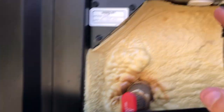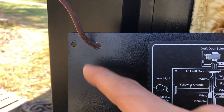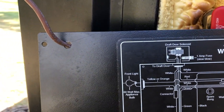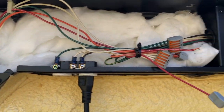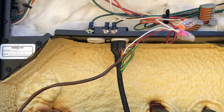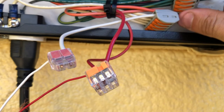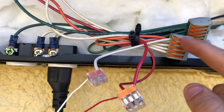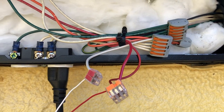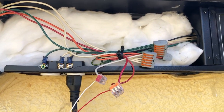So I've drilled a hole through here. I was going to go through this header plate, but this header plate is full of insulation, so I decided to come down around the side here, tuck it back in, and go through the panel. I'll put a rubber grommet on this later when I drill a bigger hole, but right now I don't have the correct size grommet so we're going to just be careful with it and put it together. Alright guys, I tapped my thermostat wire in here to the red one, made a three-connector, then tapped into the white wire with a regular piece of wire and made my own two-port Wago. So I didn't mess with the factory wiring at all — I just put a new connector here. It can always be put back to normal with the original Wago. Going to wrap this up, put the cover back on, and then I'll show you exactly how it works.